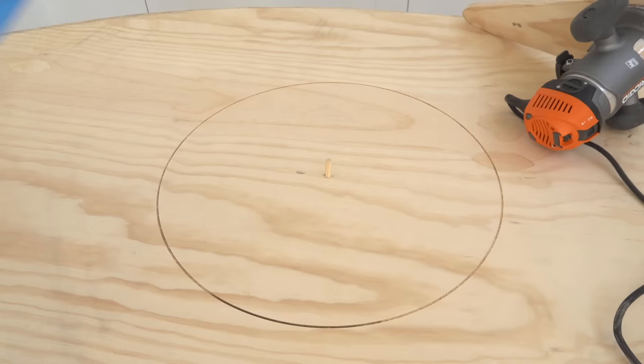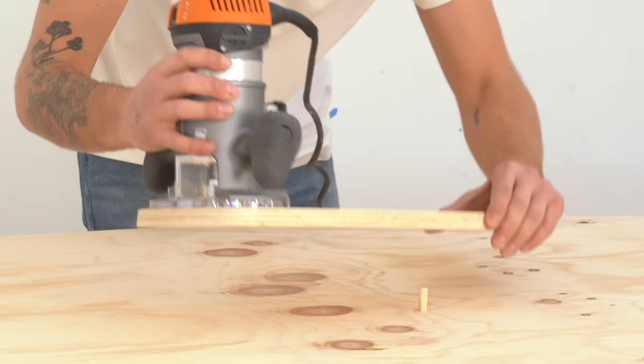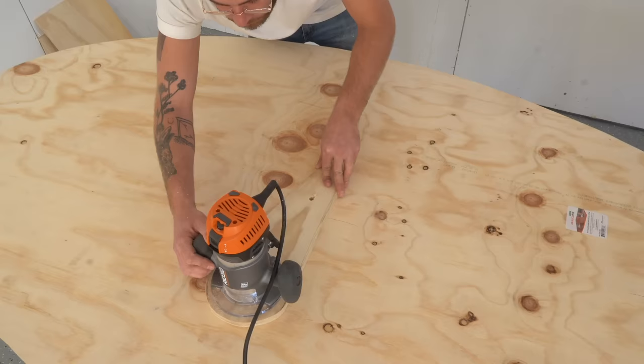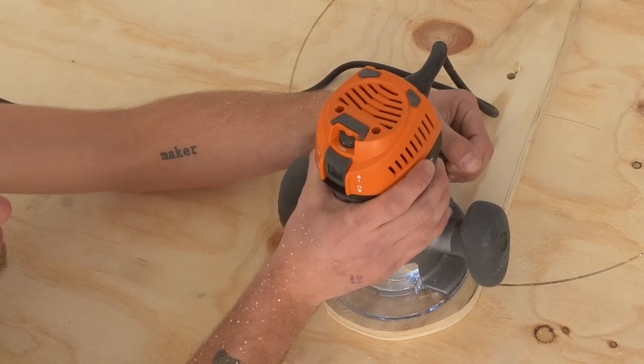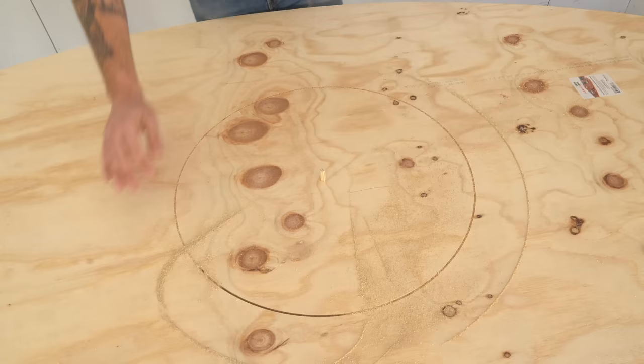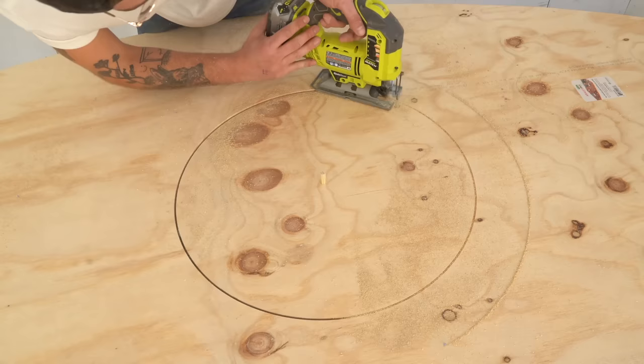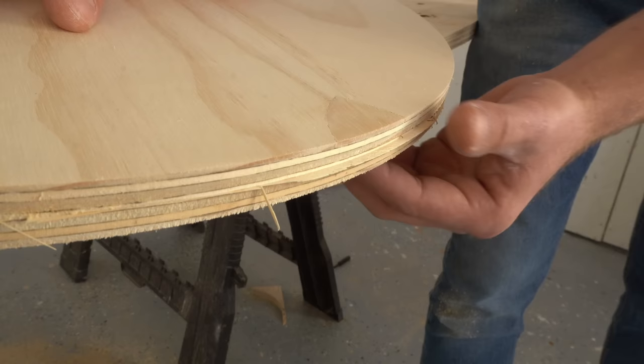This got me just about halfway through the board, so I taped everything and then flipped it over just in case it falls out in the next step. It's important that you drill that hole in the tabletop all the way through so you can use the jig from the same pivot point. I'm using the only eighth-inch bit Home Depot had available — I wanted that thin reveal between the turntable and the tabletop. I left a little bit of material holding the centerpiece onto the rest of the tabletop so it wasn't free-floating with the router running, which would be super dangerous. I cut it out with the jigsaw instead and came back to clean it up with sandpaper.